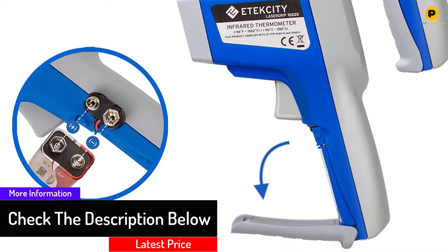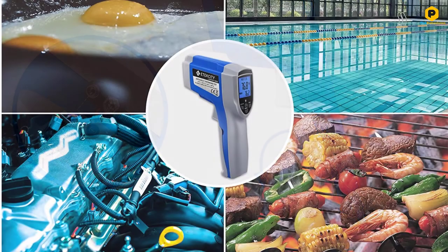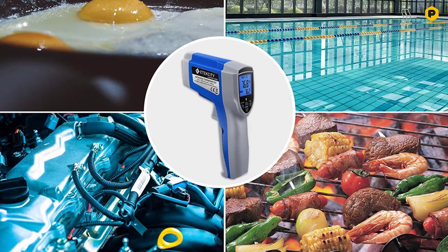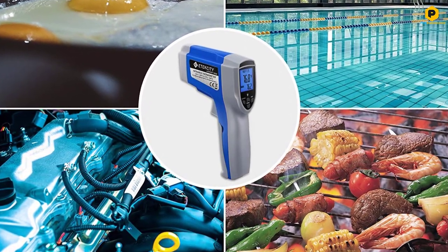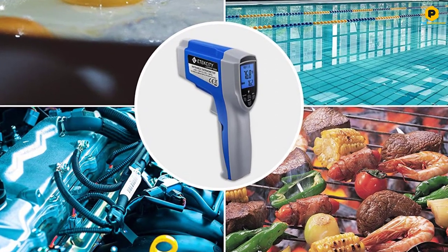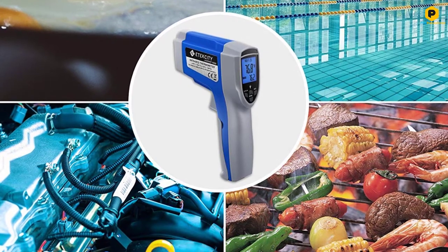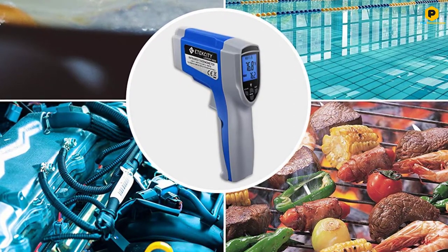The Etekcity 1022D employs dual class 2 lasers to help you take precise measurements. The ideal distance for the lasers to get the most reliable reading is 14.17 inches, 36 centimeters, from the surface or object you are measuring. This allows the two lasers to overlap and achieve the best results. And the results are fast. The IR thermometer gun will display readings in less than 0.5 seconds.